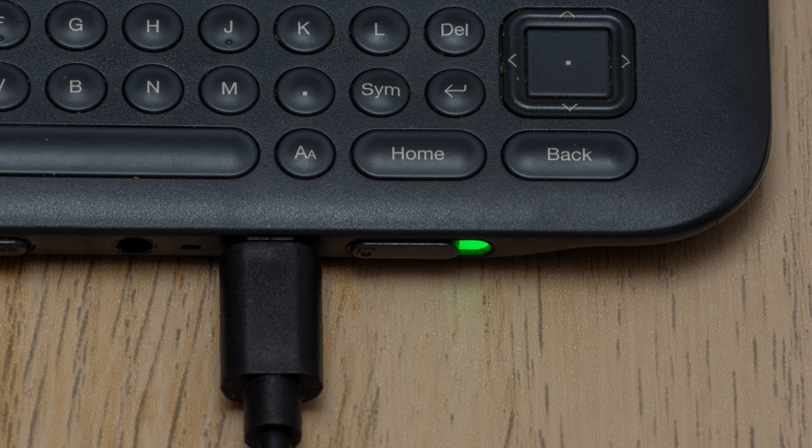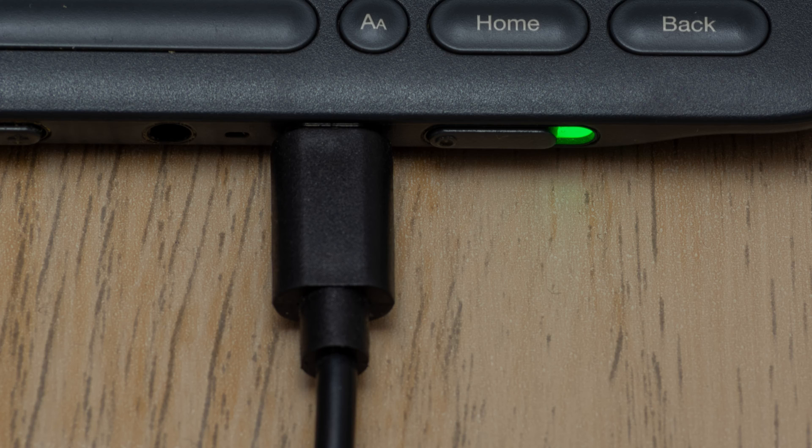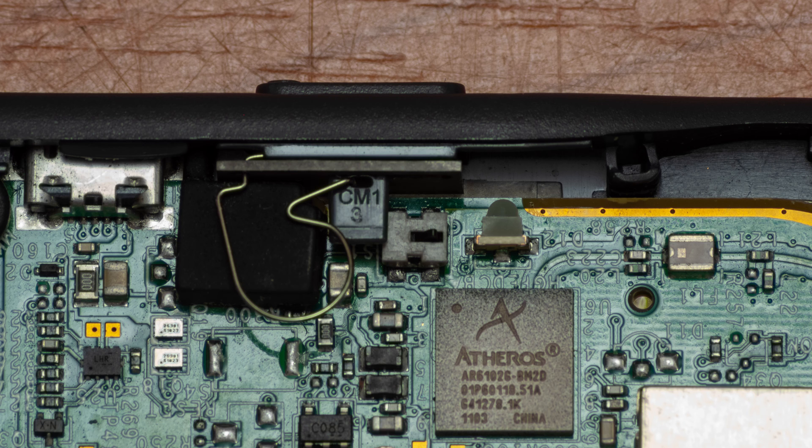The Kindle eventually tried to start. The LED turned green for a couple of seconds and there was some progress on the screen, but then it froze again. I left it to charge overnight. Next morning I tried to boot it and it froze again. I did some research on the internet and people indicated the power switch as the cause, recommending blowing compressed air over it. I did it and the Kindle started a cycle of trying to boot, freezing, and trying to reboot in a loop.